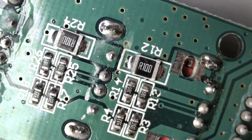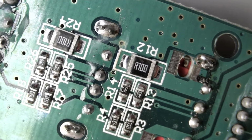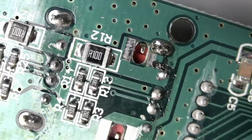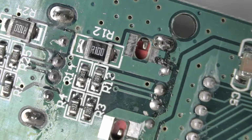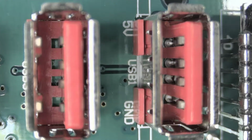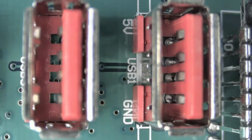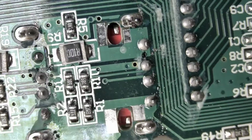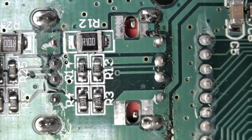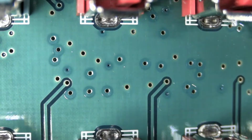Alright, so the shunts, that is a current shunt, I assume, right? So you measure voltage on one side and the other. I guess you measure the voltage across it, and that gives you how much current is flowing. Were those all through hole then? Yeah, actually, yeah. That's kind of cool. So at least the connectors are all through hole, which I think I'd prefer in this setup.